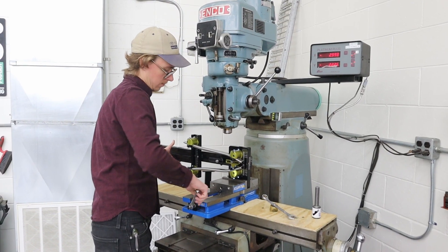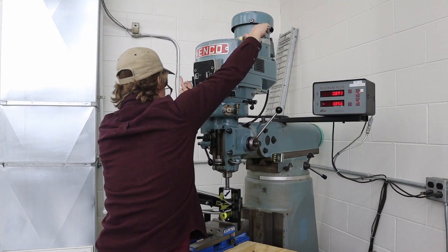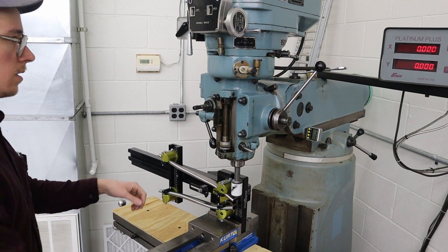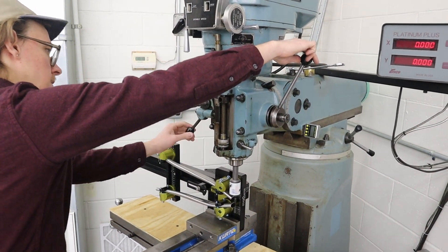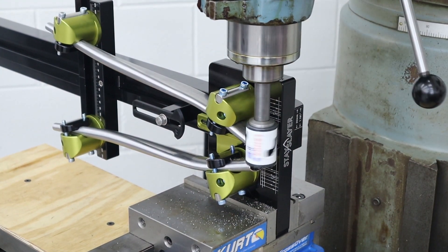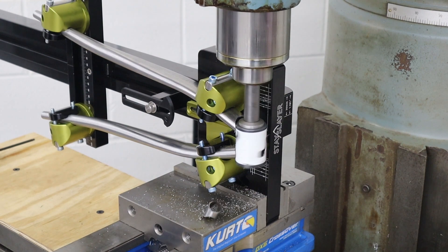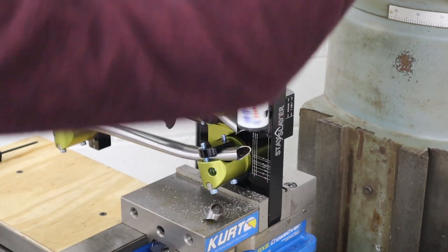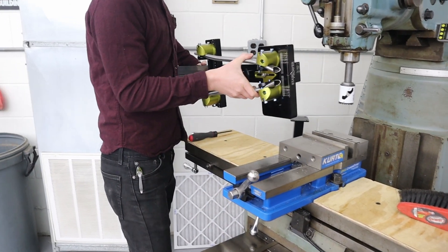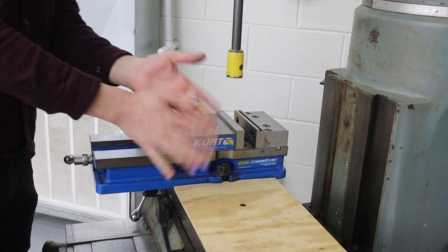I use a digital readout on the milling machine with a six-inch milling vise and I set up my cutter. This is a hole saw with a Paragon Machine Works arbor. You can set it for about 300 RPM and six thousandths of an inch down feed per revolution using the quill gearbox. It makes a nice-sounding cut because the tool is made out of solid enough material to actually support the cut. These types of cutters can be hard to get a good cut without a rigid fixture, because the tubing itself is a hard material but it's kind of thin, and you need a pretty solid setup to make good mitering — so that you get a good surface finish and cut quality, and so that your cutting tools last a while.